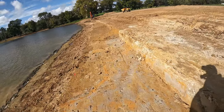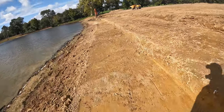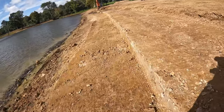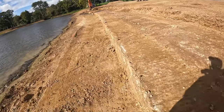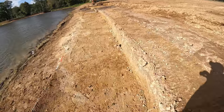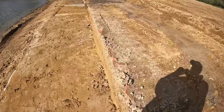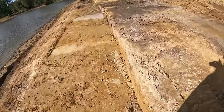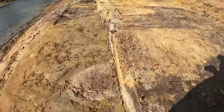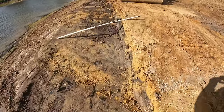So I got Rob with me, with the laser. Yeah, and the ground is soft, so the digger is leveling it up, and then, you know, two buckets full later, it just sinks somewhere. So the walls are pretty damn good here, really. Further down here, when I started going the other way, you will see it in a minute, it just isn't right. I mean, it's all right, but I don't like it. So here, almost the best way is just get a spade and tidy up with that. Anyway, go for me.